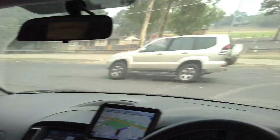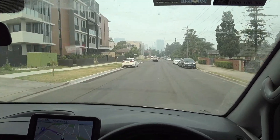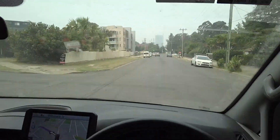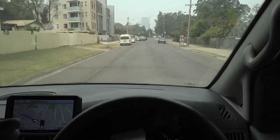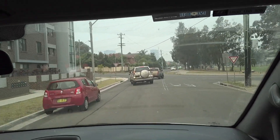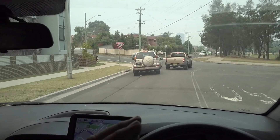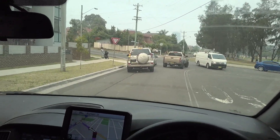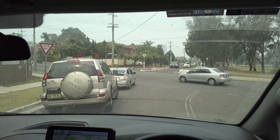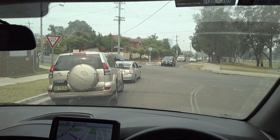Just leaving that job now. That's another job we couldn't complete to 100% status — we got most of the problems fixed. The lock was protruding about a millimeter or two, so we set it back another two millimeters — about three millimeters all up — and that made a difference. The faceplate on the 3582 was slightly recessed back because we dropped the lock back a bit. That allows the lock ramp on the latch to align with the electric strike better and actually slide back. With the 3582 protruding that much and hitting the electric strike, it was like two flat surfaces hitting each other, so nothing was happening. We also recessed the electric strike back a couple of millimeters, so moving both back gave it room and made all the difference.